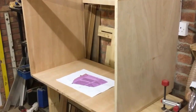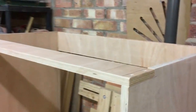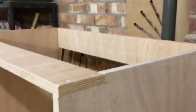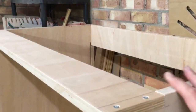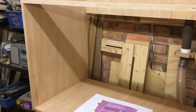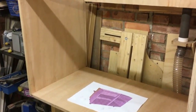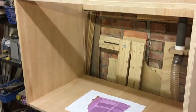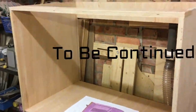The first of the carcasses is assembled — you can see the top brace and the rear brace, which obviously gives the cabinet loads of stability in terms of racking. It still needs the shelf and the centre support which the doors will close against. I'm planning to rip down a two-by-four in half to make a post for the middle, and I'll do that tomorrow.